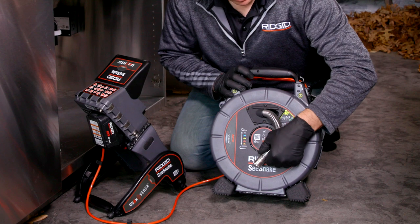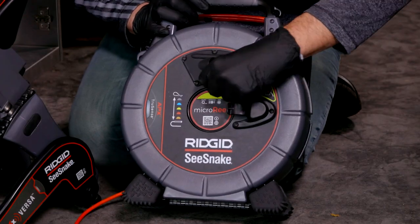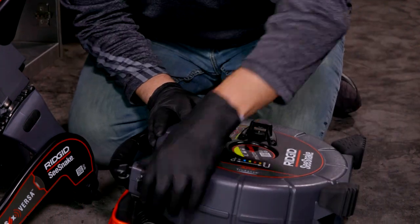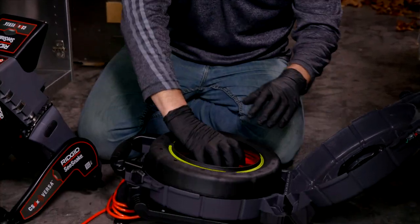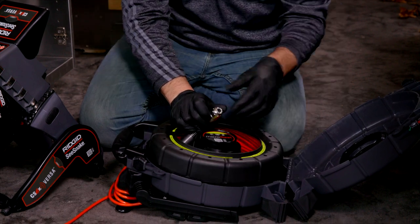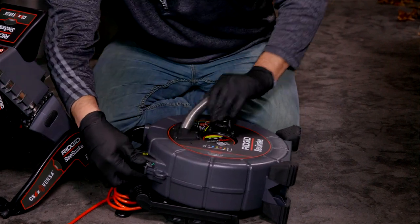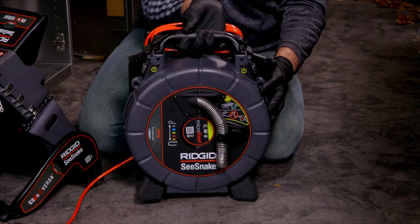With small reels like the Microreel, you can actually replace the drum. Make sure you push the camera head all the way in because there's a lot of tension built up, so when you unclip the drum you don't want the reel to actually pop out. To replace the drum, set it inside and make sure it's level. Pull a small amount of the camera head in, glide it into the hole, push down, clip it in, and make sure it's locked before you lift it up.